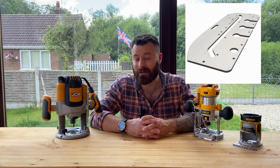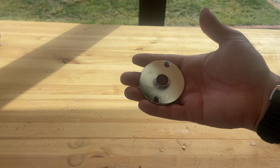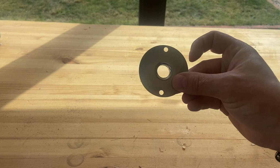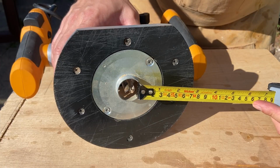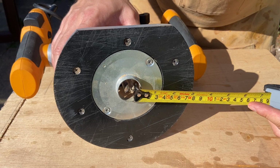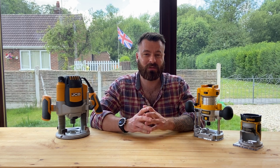You can also use jigs such as a worktop jig for those again on kitchen fitters, and a guide bushing inside your router to do so. However, if you're going to use a guide bushing and a worktop jig, you need to make sure you add the distance from the blade to your guide bushing onto your marked cut line, otherwise you're going to cut your piece too short.